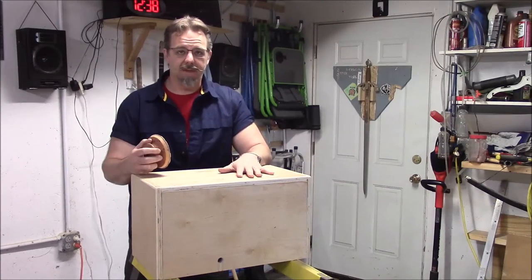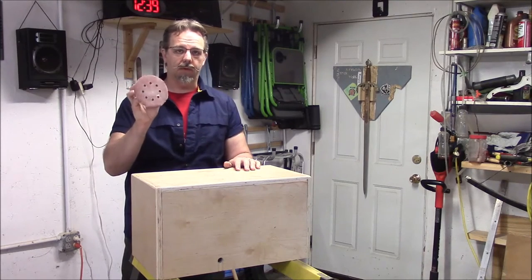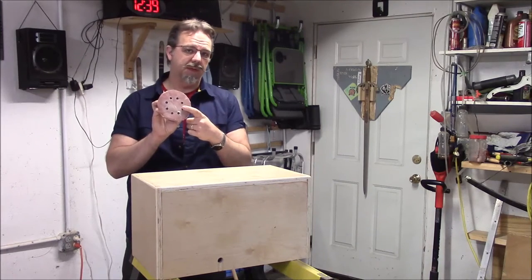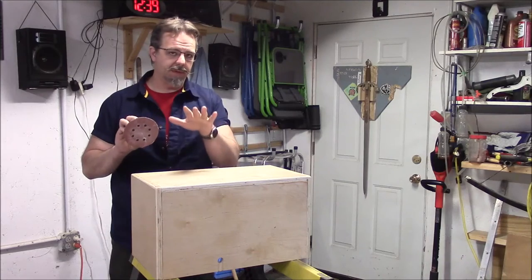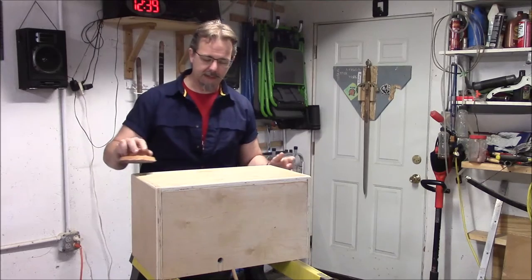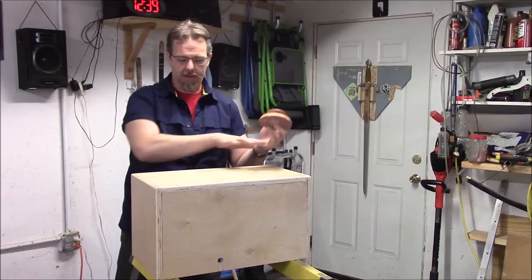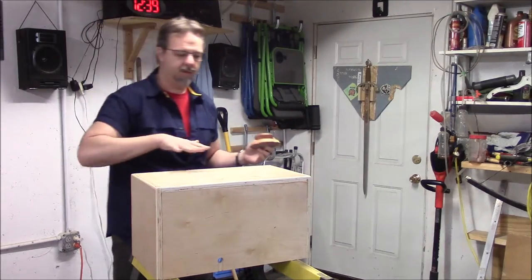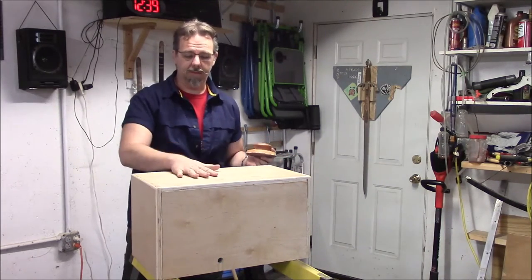We've moved to the other side of the shop to finish this up. The polyurethane is dry, but we've got to knock it back with some high-grit sandpaper — this is 220, a tired old piece I've been using on other things, but it'll make things really nice and smooth. When sanding, you want to go with the grain. On the back it goes this way, and on the sides it goes this way — you don't want to cross the grain at all. Keep everything nice and with the grain of the top veneer.